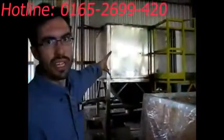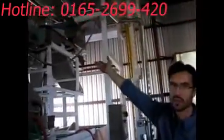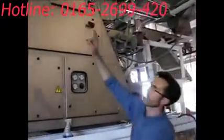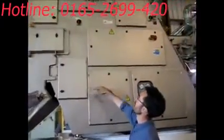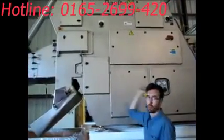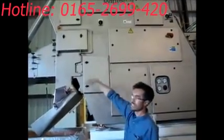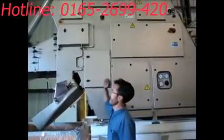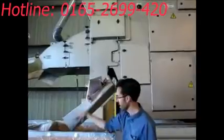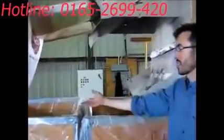The walnuts are then dumped into these big hoppers here to go up in the elevator, down some vibrators to feed the machine, through this laser. There's a top and a bottom laser in here, and a set of cameras to look at the meat. As they're flying through, the computer can determine the rejects from the good ones, and decide to kick it out or not. The bad ones are kicked out here, and the good ones keep falling through over here. As you can see, it works extremely well and extremely fast.